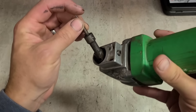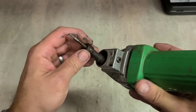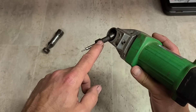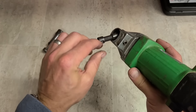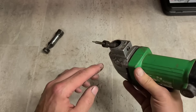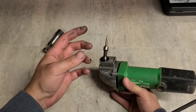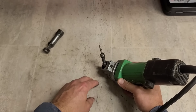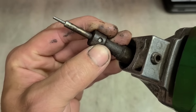There's a grub screw in here and it's started to rust - it's been exposed to water and left dry. Normally when you get a tight grub screw, a good new allen key is what you should use, not an old one because an old one will be rounded over. Use a fresh one to see if you can get it out. If the allen key is bending too much you're going to strip out the head. This one's already stripped out. Got a new allen key, still slack. Heated it up with the blowtorch - still won't come out. Sat it for a day in penetrating fluid - still won't move. They also have stud extractors, which are basically oversized torx you beat in to the grub screw to take it out even if it's stripped. Even the extractor snapped off inside.